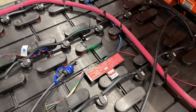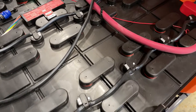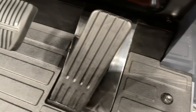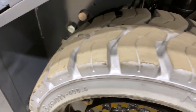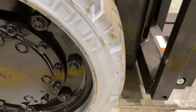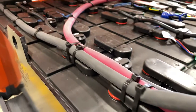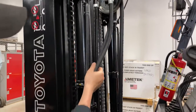When watering your batteries, do a visual inspection to ensure that the terminals are clean and there is no visible damage to the battery. You need to check the floor pedals for wear and tear. Always visually inspect your tires to make sure they are not showing signs of wear. See that cables are not cut or frayed, which could cause sparking. Inspect all hoses, making sure there are no visible cracks or leaks.